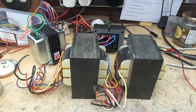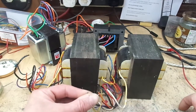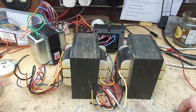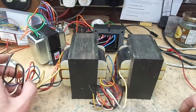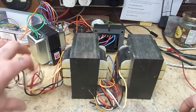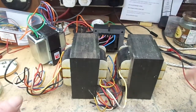and we've got another couple of output transformers from my good friend Joe Bogatek in Australia. He kindly let me have these for a really good price. They're the same as the ones that were in the 807 amplifier. They're basically built for EL34s, 807s, whichever. 3K4 primaries. They are ultralinear taps, and I think they're just 8 ohm secondaries, like the Primary Windings ones.